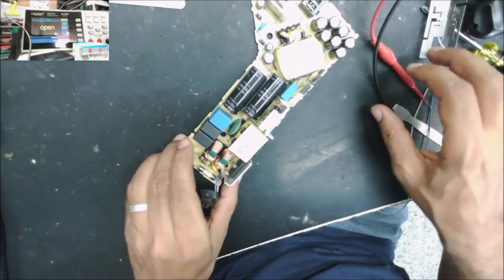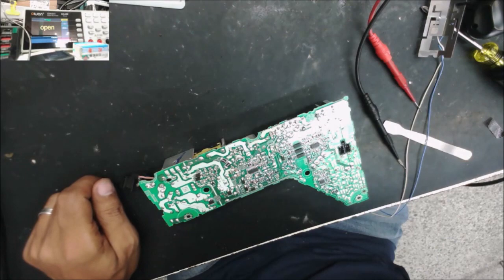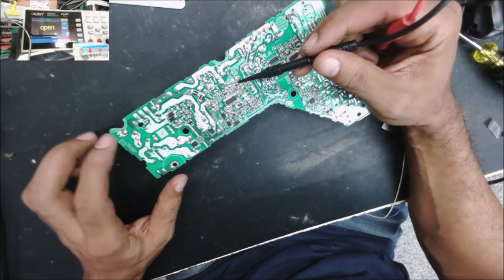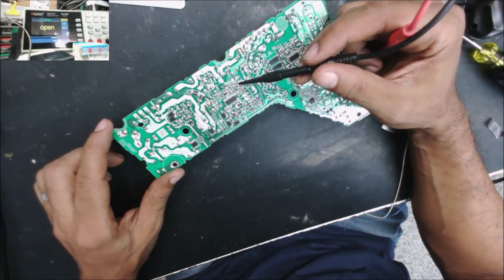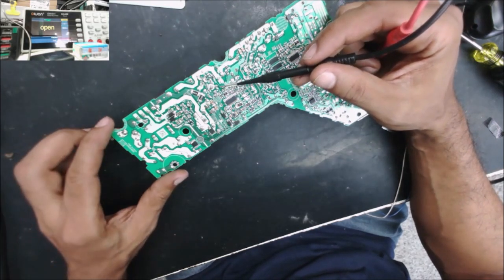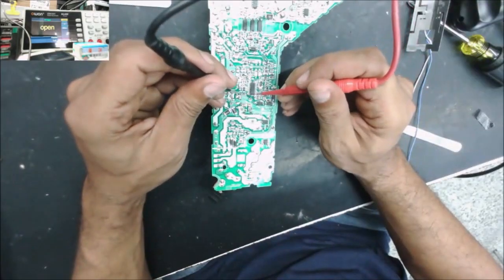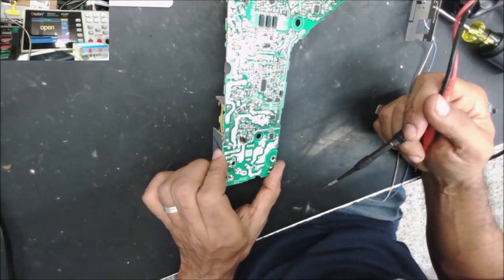The low ohm resistor is good, this one here. The problem when the MOSFET is shorted, right before the fuse opens, is that it sends that high voltage, that 110, to the pin called the gate. That's supposed to be 12 volts or something around that. So it goes around this resistor, it goes to here. This 1 kilo ohm resistor shouldn't be shorted.